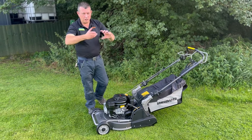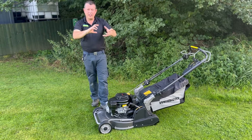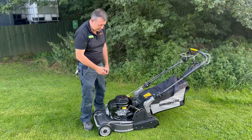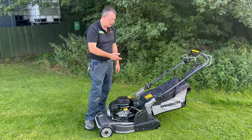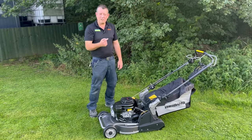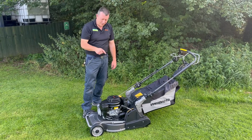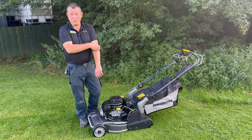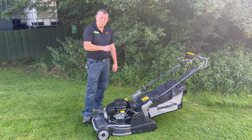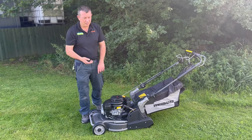It has a split roller, a bit like the Honda mowers — so when you turn at the end of your lawn it's not skagging the grass up, nice and easy. One thing I've noticed: this is a monster. It weighs 67 kg, which from memory is more than any Honda mower on the market right now. This is the 19-inch, and the Honda 21-inch only comes in at 58, maybe 60 kg.